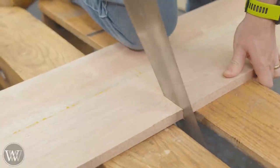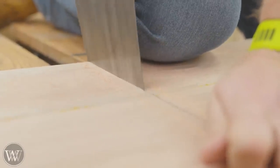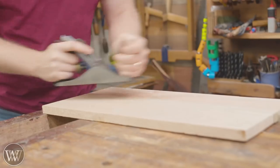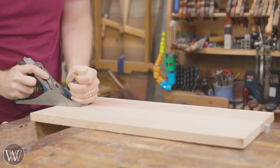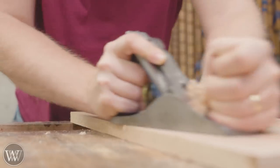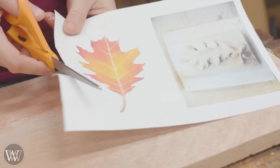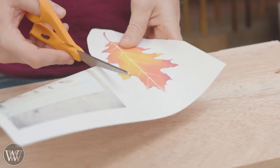Now we want to actually cut it to length, because we glued up more than we needed — the boards came four feet long and we only needed about 30 inches total. We're going to cut off the end and clamp it down. It's great to have the saw vise and saw bench so you can work lower, even for things like this where you're crosscutting a larger piece. Now we want to come back and clean up that glue line and flatten out the slab. This one didn't need too much — it actually flattened out pretty well. We're going to be making basically a large crest that will display this flashlight.